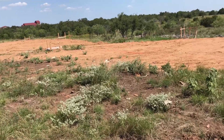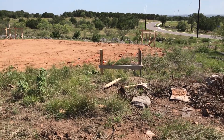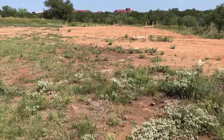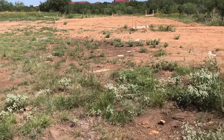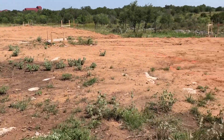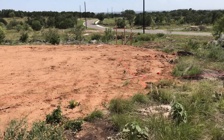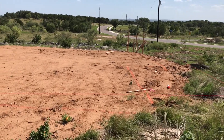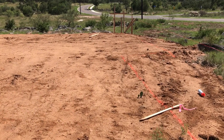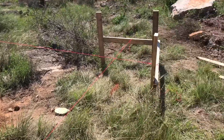This house is our set design and it's for the Mason family. We started out on the high corner way over there and set that in at 12 inches. You can see the level so that the actual slab itself — the back batter board shows you where the top of the slab is going to be.